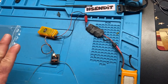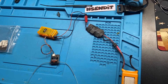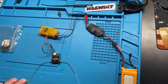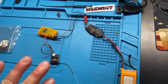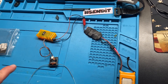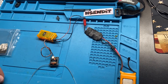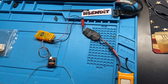This thing will automatically, right away, bind to your transmitter — it's literally that simple. This device has worked amazing for me; it works every time. It will make binding any Spektrum receiver that simple. I'm going to send all this along with the new receiver for you, because I have no use for it anymore. You can use the one that's in your drone — just take the canopy apart, make sure you get to the plug, plug this harness into the receiver plug, leave it right in the craft, do this, bind it, and you're done.